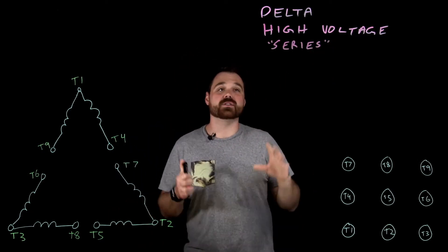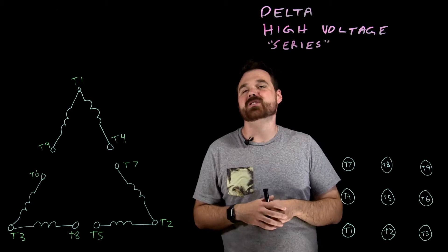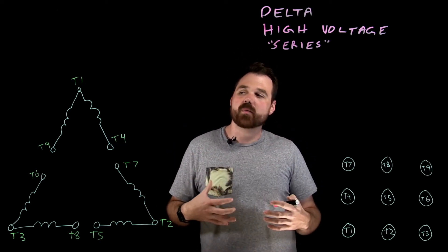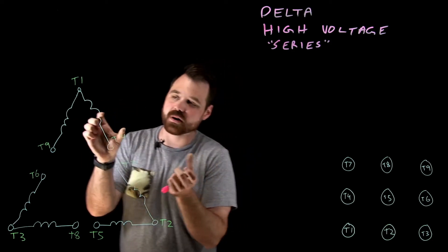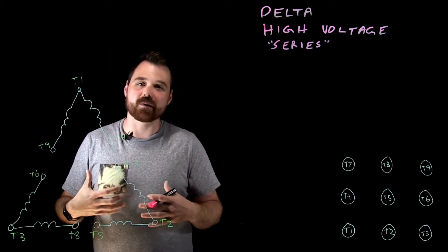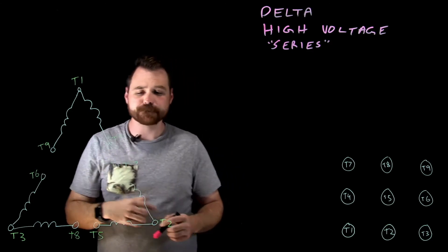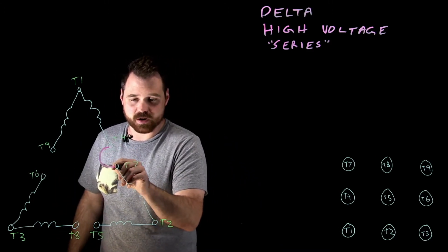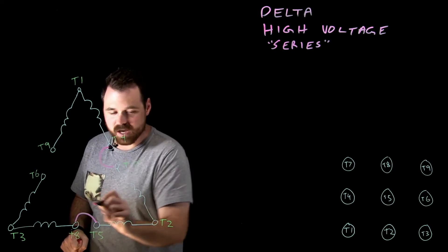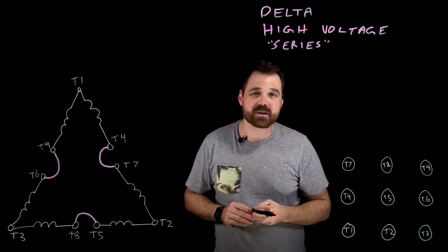I do have another video if you're looking for the low voltage connection — low voltage Delta motor connection. But this one we're talking about the series high voltage connection. When we're talking about connecting these windings in series, both windings rated for 240 volts — put them in series and we can apply 480 volts across them. We have to think about polarity — we want current to flow through them in the same direction to get that correct rotating magnetic field. So we're going to connect T4 in series with T7, T5 in series with T8, and then T6 connected to T9.